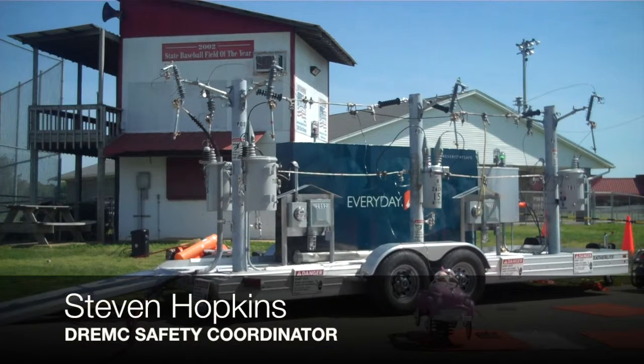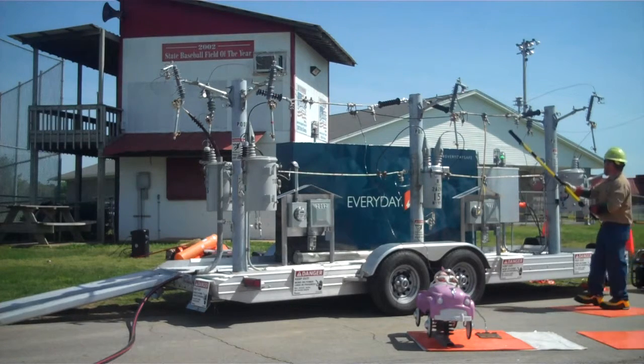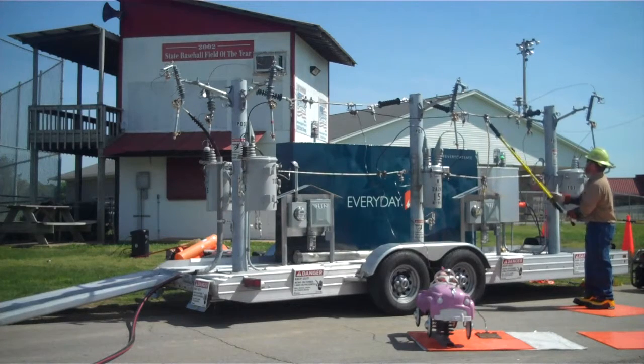Fan there, we have that yellow cable connecting our primary to our neutral. That is our personal ground. Anytime a lineman is working on the line de-energized, it's never considered de-energized until two things happen. They have to get a visible open point and also put this set of personal grounds on each side of the work area. That makes it protected for them, so they don't have to worry about the voltage coming back to them.